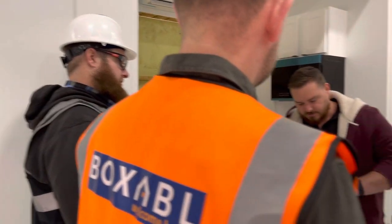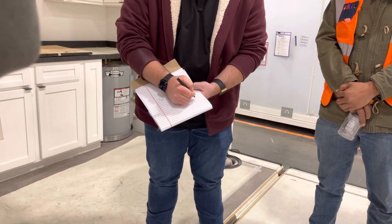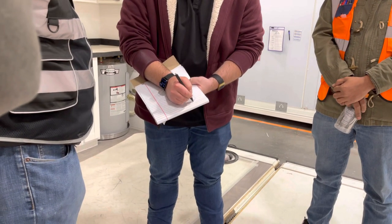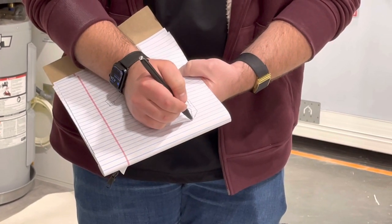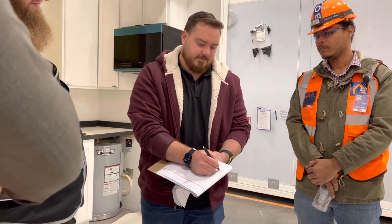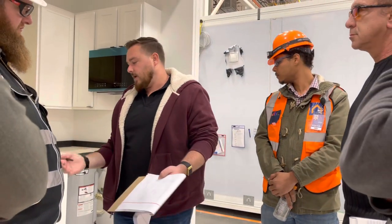So that piece of trim is shaped like this: you have your toe screw here, there's your wall. This piece of trim comes up like that, comes to a point past the wall, then comes back and hooks to the trim here. So you should have a sharp point where it meets the wall, and it should be pushing into it as they hook it onto that toe screw. It's actually a flat, but like a fake point, about 10% over, so that when you hook it on, it makes a clean seam. That's the theory. It's supposed to be doing that. It's not doing that. It's designed to.